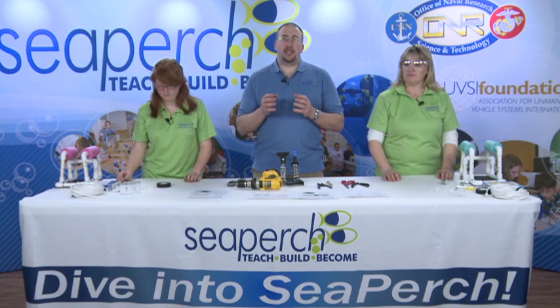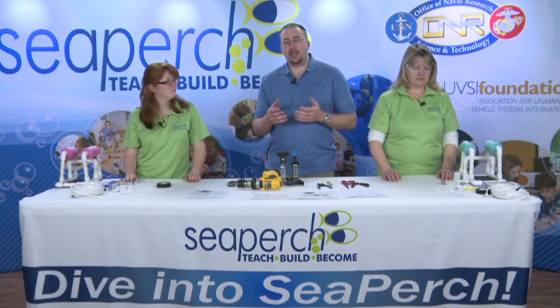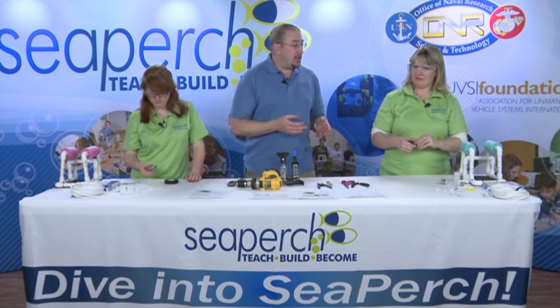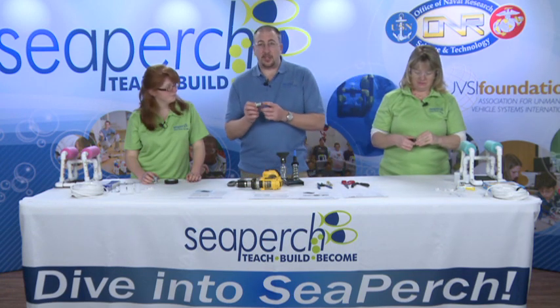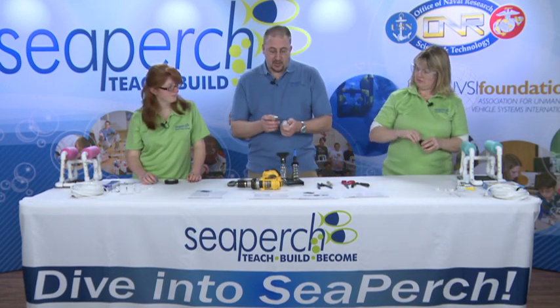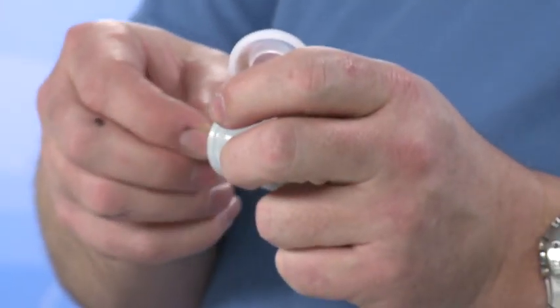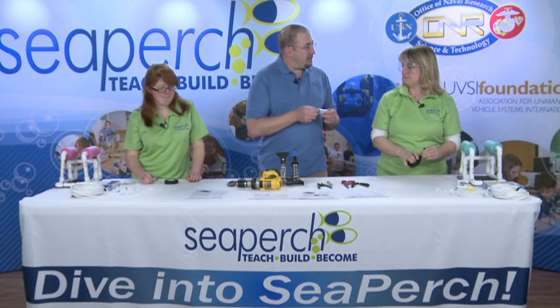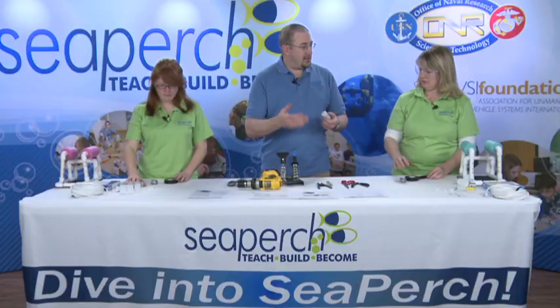The first part of this is taping up the motors so that the wax we use doesn't get into the motors. Some people have a tendency to just grab the tape and start throwing tape all over the place. The key to this is less tape is more. The whole idea is that you're putting tape around this motor, and that taped motor needs to fit inside this canister. There's not a ton of extra room. So the more tape you put in, the less leeway you have for other things later on. The least amount of tape you use, the better off you're going to be.